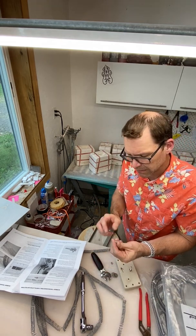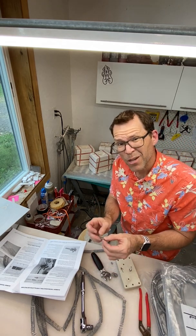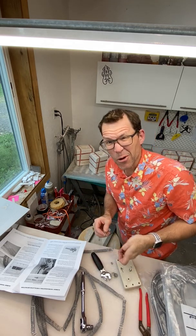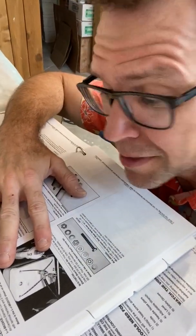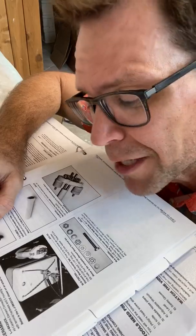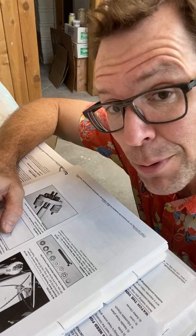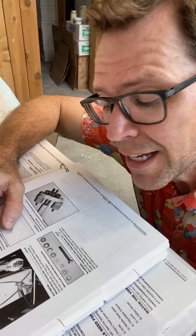We got it out. But can we replace this? It is just like a stainless steel bolt, but I'm going to have to cut it off with an angle grinder because it's frozen on there, and I don't want to force it and crack this high-temperature porcelain fitting. Time to make a phone call. Thank God for good manuals — L&L Kilns, you put together a great manual. Looking through the manual, I can see this is a 10-24 stainless steel bolt, one and a quarter inches long, which I think I can find locally. That's probably going to be it for today — it's Friday and getting late.